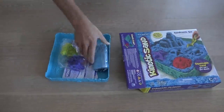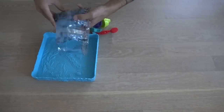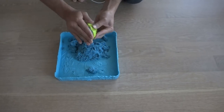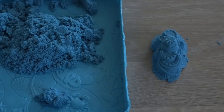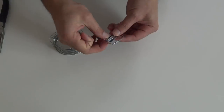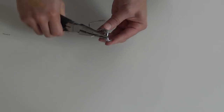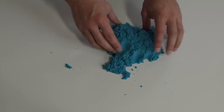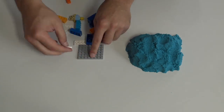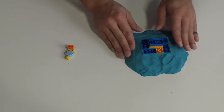One of the most interesting things we found was this kinetic sand. It just has a really weird feel to it — it sort of feels like regular sand, but it sticks together a little bit more than you'd expect. I've done some other casting projects with it, but this would be the first time I tried to make something functional. I got some blank belt buckle hardware off Amazon and twisted some wire through the holes to create something that the molten metal could eventually grab onto. I compacted the sand into a little mound and then used Legos to compress the shape of the belt buckle right into this mound of sand.